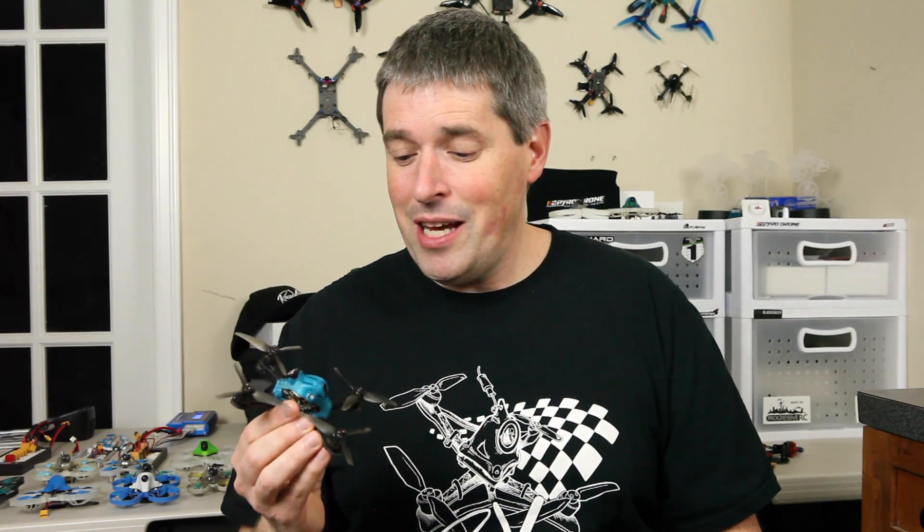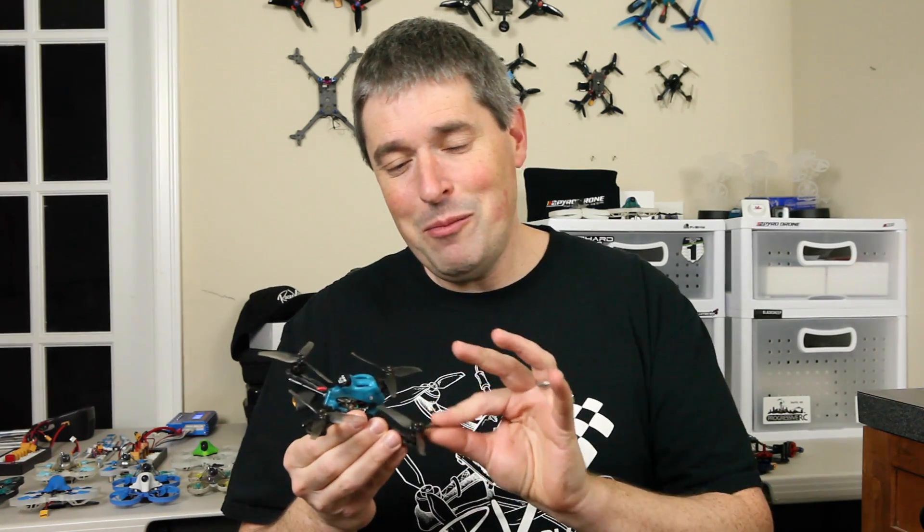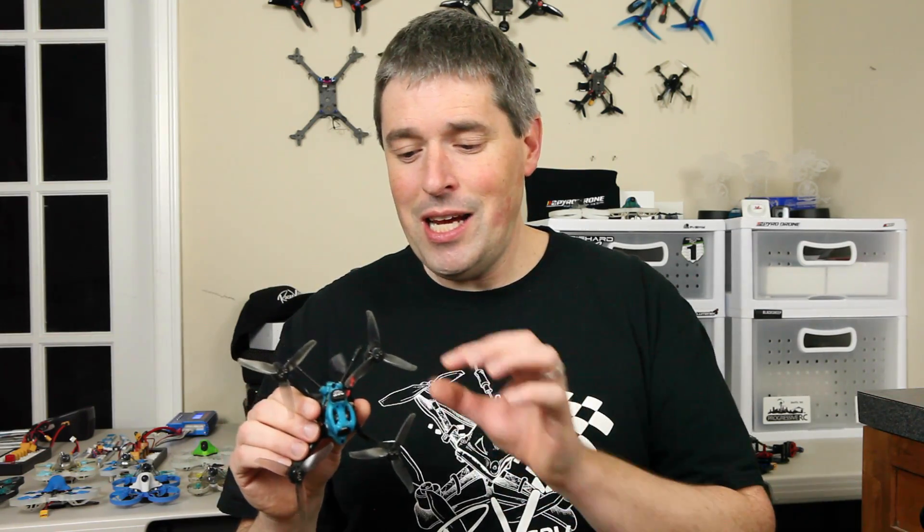For this one, I tried to go a little bit lighter than my other three inch builds by using 1103 motors and see how good that could be. The most surprising thing about this whole build is actually the props. I want to thank my friend Cliff — he gave me a set of these props to try out and I was really surprised by them. It's the Gemfan Hurricane 3016 prop, and that's a lower pitch than I usually fly, but it's got three blades, it's super light, and even these small 1103 motors can manage it surprisingly well. It's super smooth, lots of throttle resolution, and still really fast. So this build turned into something actually kind of interesting. I do get myself into trouble with this build — I'll tell you about that in a bit and show you some flight footage.